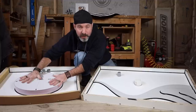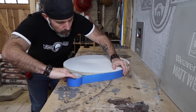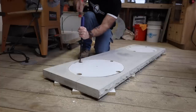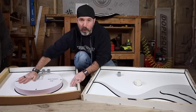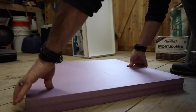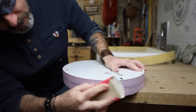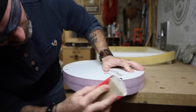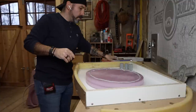As far as the knockout for the undermount sink, usually I would cut this shape with scrap melamine, but nine times out of ten that would cause issues — when I'd go to knock the wood out it would cause too much pressure, causing cracking either up high or down low. So I ended up using rigid foam. I got two one-inch thick pieces, glued them together, and cut out my shape. Rigid foam is actually pretty sandable — I was impressed by how smooth you can get it with 150 grit sandpaper. I still wrapped the sides with packing tape and glued it down into position on the mold.